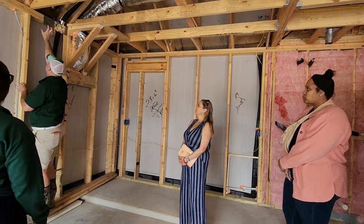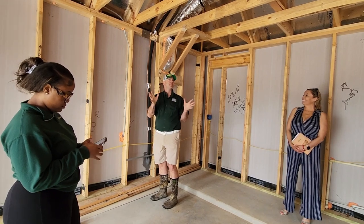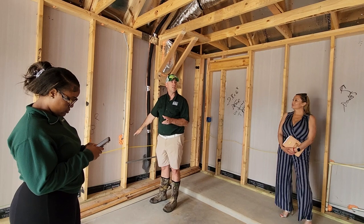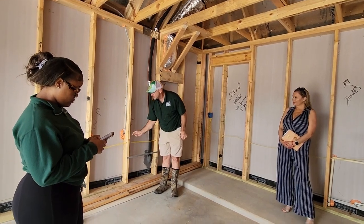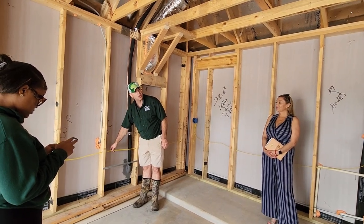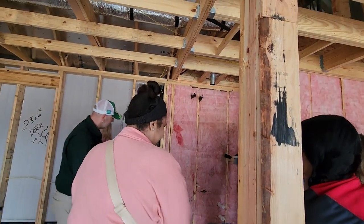What is this thing? Strike plate. If you've ever been in your house and tried to put a nail or screw and it just won't go through, there's something on the other side of that. So if you didn't put this here and you're putting your drywall up and your AC system was charged with refrigerant, it leaks everywhere. If your electrical is within one inch of the surface, you've got to have a strike plate over this wood so that when you're hanging drywall you don't hit this and arc it out. What's going to be right here in this area? A water heater. There's no such thing as a hot water heater — it's a water heater.